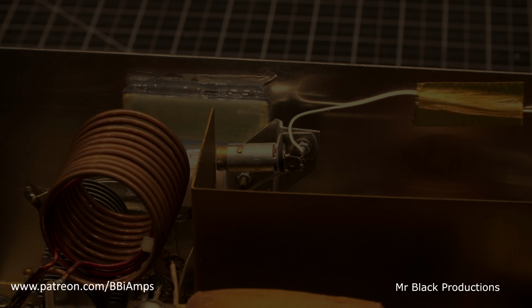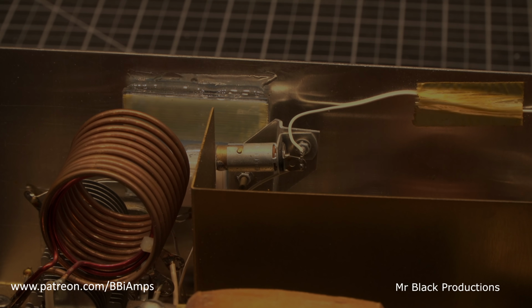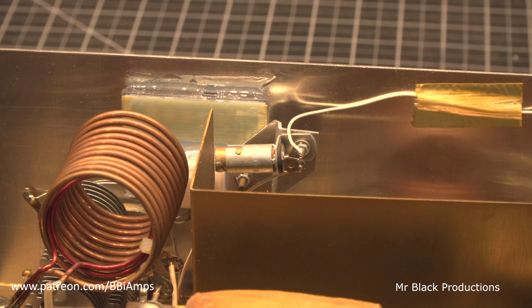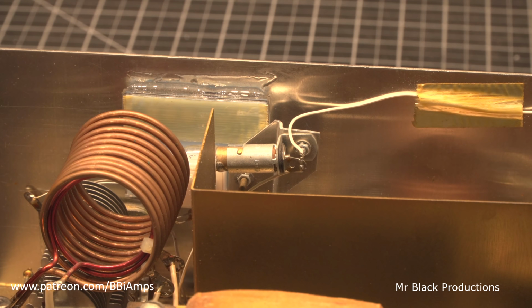Let's start playing over here, as we let that time-activated 10,000 PSI epoxy set up. Don't use super glue on meters, you guys. Please, cyanoacrylate just leaves white residue on everything. Go to your local hobby shop. Hell, go to your Ace, go to your Home Depot and get 2-part 5-minute epoxy. Do a 1-to-1 ratio on it. Put down tape where you don't want epoxy to get on stuff.